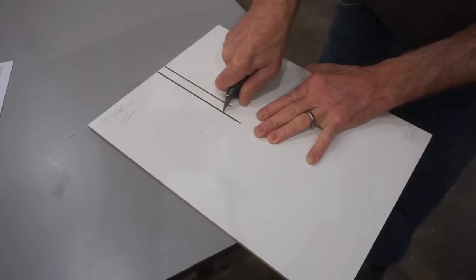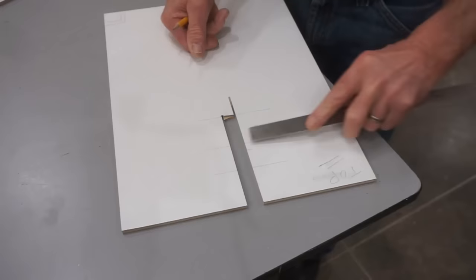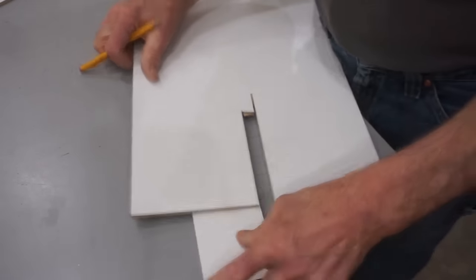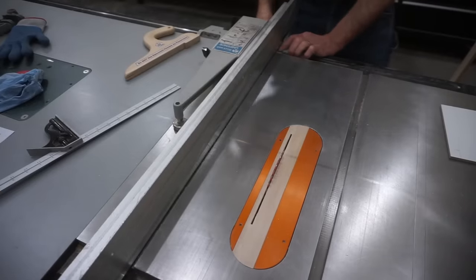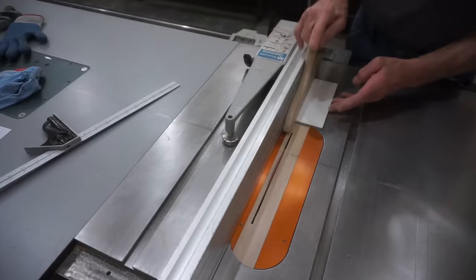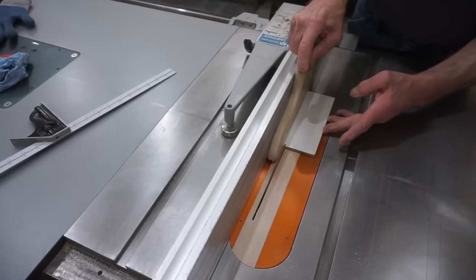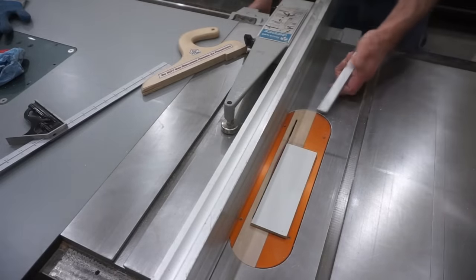And don't worry about the ragged end in this slot, because as you'll see in a few minutes, it doesn't matter. These steps will leave a slot exactly 3/4 inch wide, so mark and cut a strap of template material about 4 inches long with a snug fit in the slot. If anything, err on the wide side when you're cutting this strip, because it's easier to cut another skosh off for a good fit than it is to add a skosh on if the initial width is a sloppy fit.